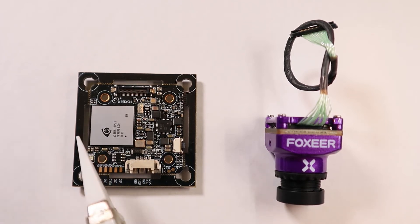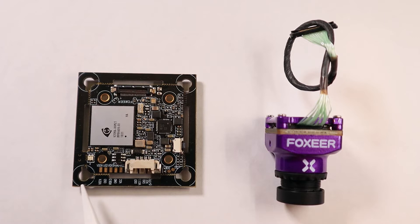Further on your PCB, you got your 30x30 screw holes, and a little bit to the inside you got your 20x20 mount. You can change the PCB by breaking off to this line — you can see all the little holes drilled around. Here you got your power on or auto record button.